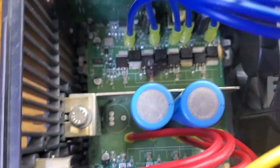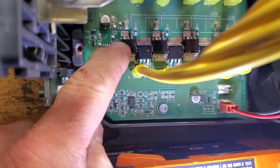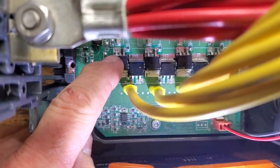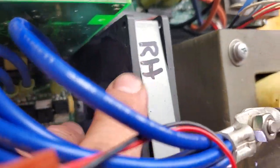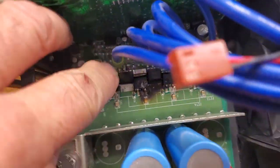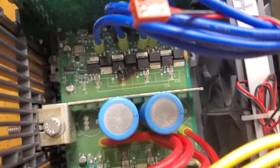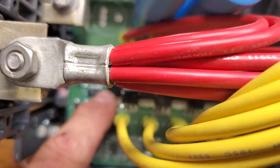All right, so we're back. Notice this side - that's a MOSFET, metal oxide semiconductor field-effect transistor. Notice this fan right here is on this side, this fan is on this side. What happened was the fan stopped working and it burned up - you see it down in there? It burned up the field-effect transistors, the switching transistors. One time this one will switch negative, this one will switch positive.